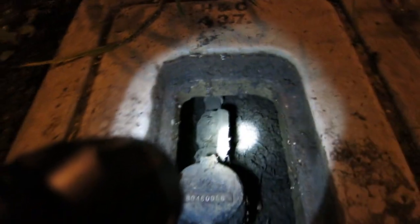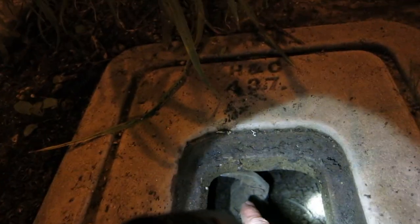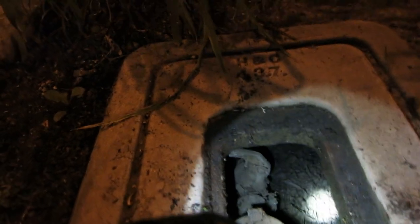Here is our water valve with our little handle switch valve right here. Now, as you can see, it's vertical, which means the flow of water is going. We're going to crank this to the left. You might want to rotate your hand, slip it on in there, and you're going to crank it to the left so it becomes horizontal. That means the flow of water has been cut off. Horizontal, it's been cut off. Bring it back to vertical when you're done and that will increase the flow. Vertical means on, horizontal means cut off completely.